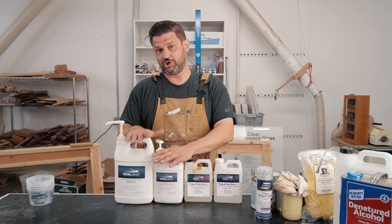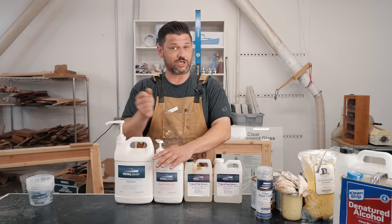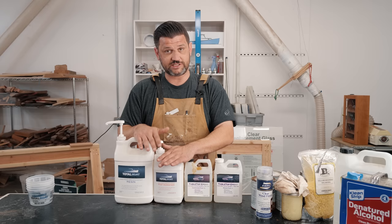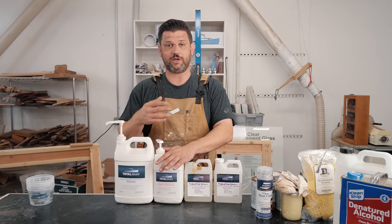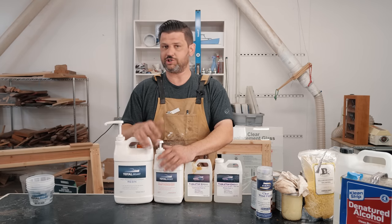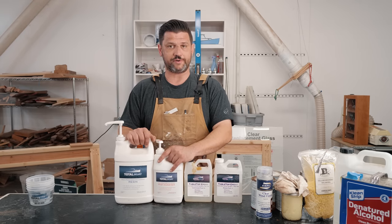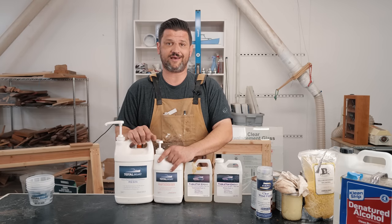One of the tricks I'll use with epoxy is a heat gun after I lay it down — just keep going over it and that helps it lay down. Sometimes you have to put it on, sand it really well, and then do a really light top coat to get a nice finish. This is what I use in high-water applications and, of course, to fill imperfections, cracks, and things in projects — I wouldn't use anything other than Total Boat. So let's get into how to apply them and how to make them look good.